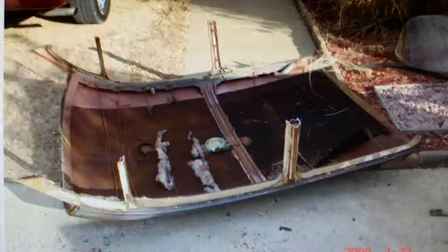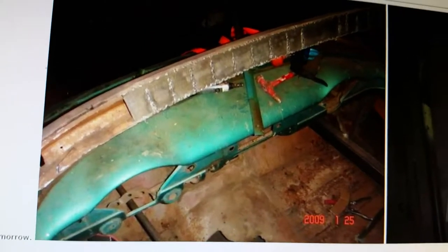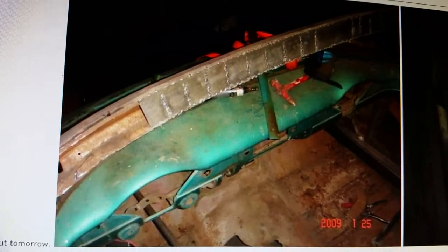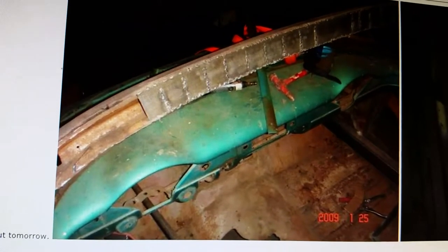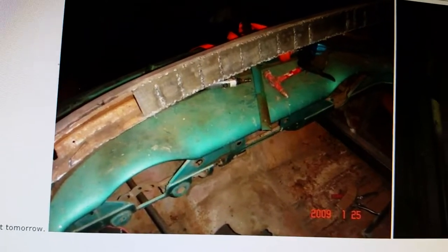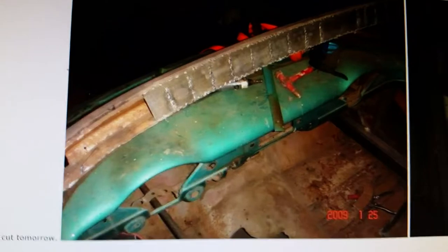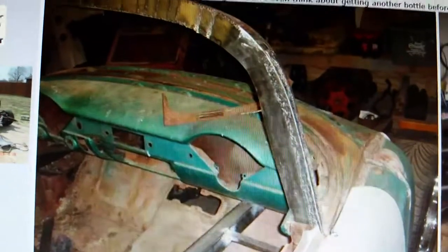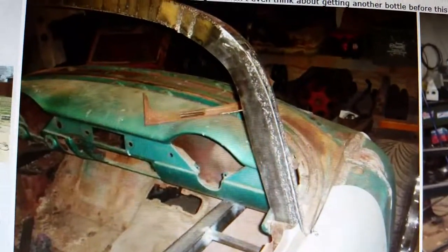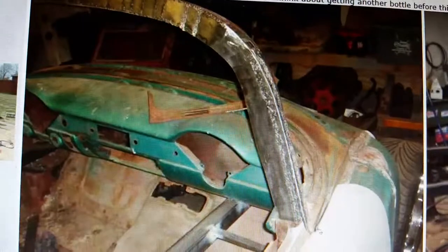There's the roof laying on the ground. At that time I didn't have a lot of sheet metal equipment, so I took a long piece of strap, made some slices in it not all the way to the end, which allowed me to fold it. Then I went back and welded all the cuts back up — that's how I got the curve to plate back in the windshield post. There are some end cap pieces I made out of steel, and that's them welding in.